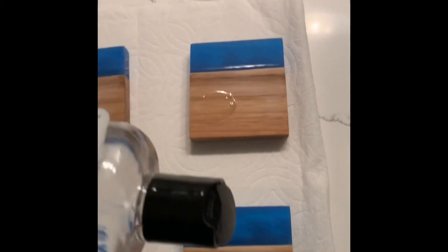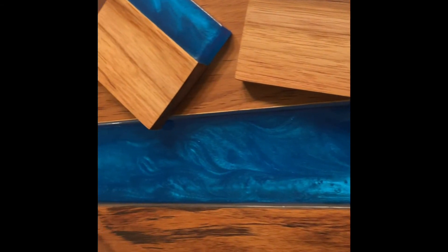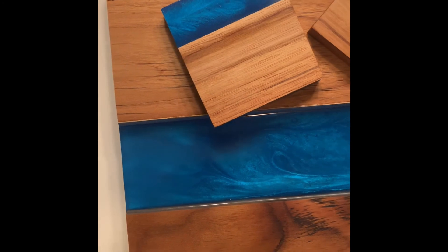Just rinsed off the residue and dried them. This is the oil I use — it goes on nice and does darken the teak a little bit. It's food safe — you just use your hand, swipe it in, and let that dry a couple of days so it really gets into the wood. Here's our board — the back — and we put some feet on the back. There are your matching board and coasters! If you have any questions let me know, appreciate it, thanks.